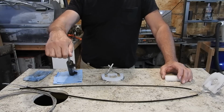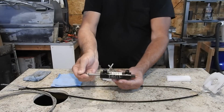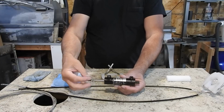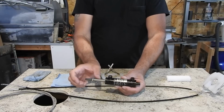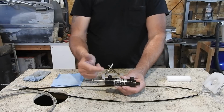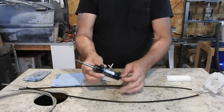But in the first part of this video, you did see that I changed my master cylinders out. This is the original one. You can see it's a lot bigger in diameter, it was a 1-inch diameter. I got lucky in that the new one had the exact same fittings, exact same thread size, so I was able to take my long fork off of this and put it on the Matco brake assembly, and I was able to get the length I needed with it screwed all the way on. It was just like this one was. And then I did have to come in and grind the bottom to get it to fit in the holder on the bottom, so I got that all done.